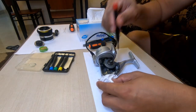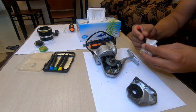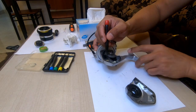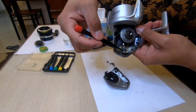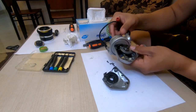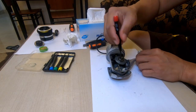There are two. So I have to support this one. You have to remove these two first, and then pull the shafting apart. And then remove the pinion and the driver — here, the driver.